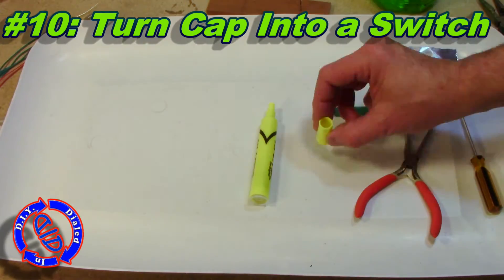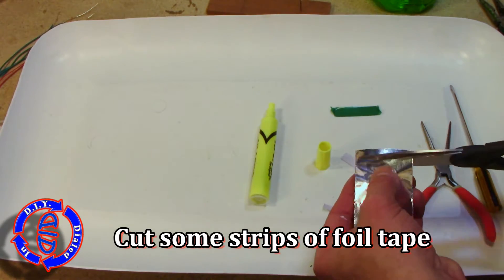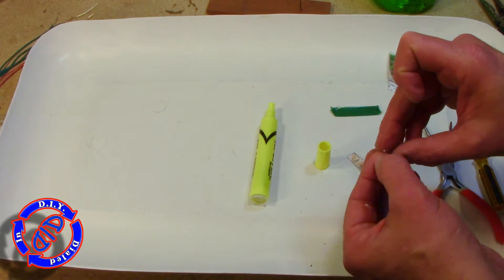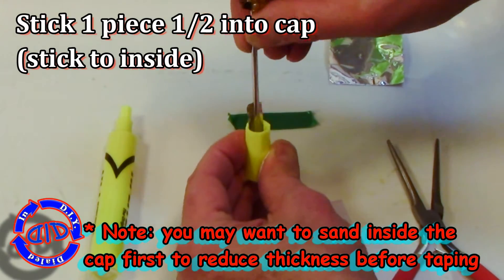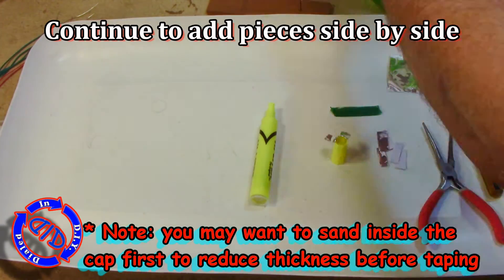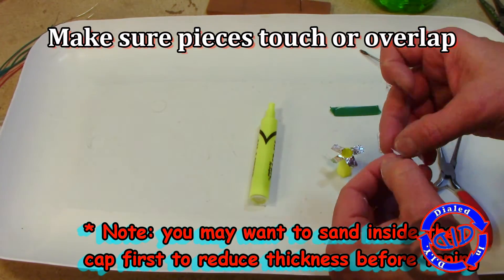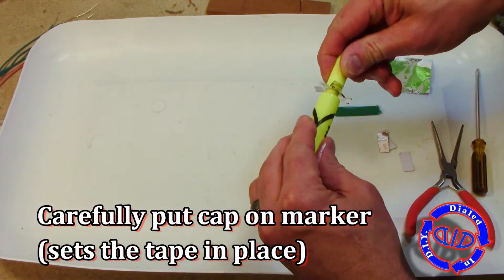You'll remember how when we tested it, all we had to do is make a contact between the two wires in that end cap to make everything work. We're going to turn the basic cap of the pen into our connection, and we're going to do that with a little bit of foil tape. I picked up mine at Harbor Freight, but I've also seen it at hardware stores and even the dollar store. This foil tape operates much like a sticker, which means it has a covering on the back that you have to remove to expose the adhesive part. Put the adhesive part down inside, then push it against the inside of the cap and fold it back a little bit. This is going to make it a bit thicker on the inside of the cap, so if it's a snug fit when you put it on the bottom of the marker, you may want to sand down the inside of the cap just a little bit before you put the tape in place. Once that's done, go ahead and put the tape all the way around, making sure the foil connects all the way, to make an electrical connection when we add it to the bottom of the marker.